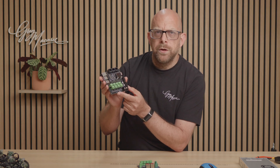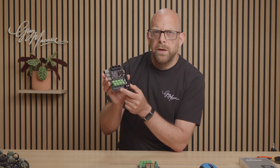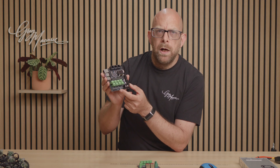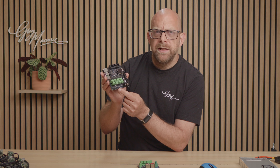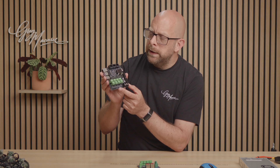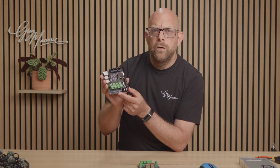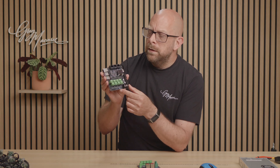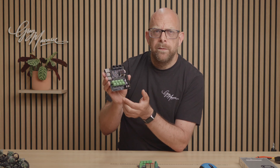These PowerMux chips can signal to the controller when they go into a fault state - i.e. they have shut down the power - and they can tell the controller that this has happened. They can also tell the controller how many amps or milliamps are being pulled through each port at any time, so they've got a current sensor, a bit like the ammeter we used last week, telling the controller how many amps are running through each port. They can also act as a switch so that when the controller is not being used - if it's in idle and we're working on the setup - it can turn off the power to the pixels.